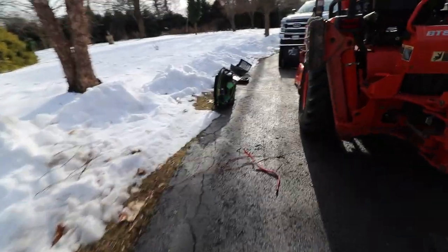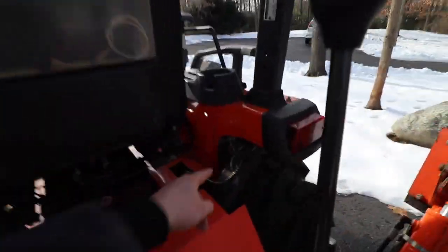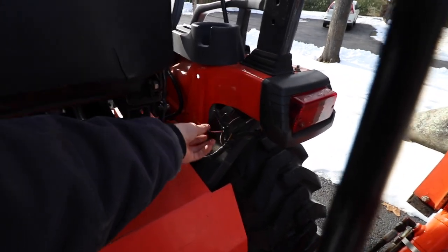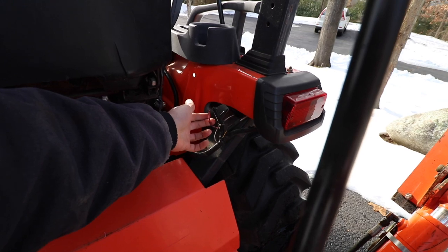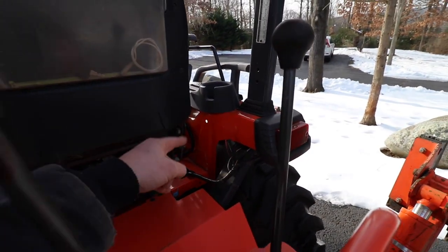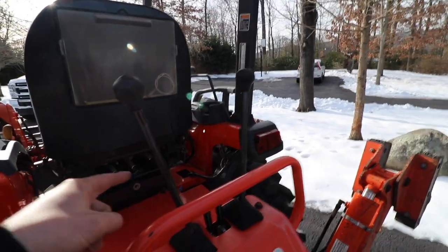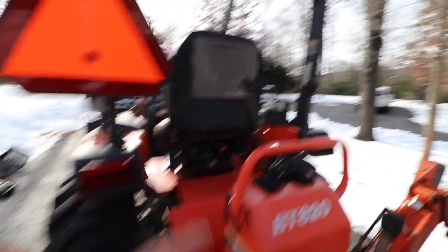All right, so I removed all that wiring that went in between that switch and that rotary beacon there, and I actually pulled power out of here, one of these wires, I think this red and blue wire, which, if I remember correctly, was probably just some accessory power wire that was just sitting there, so I chose to go off that. And before this job is all said and done, I gotta make sure I wrap that up so that it doesn't make direct contact with the frame.